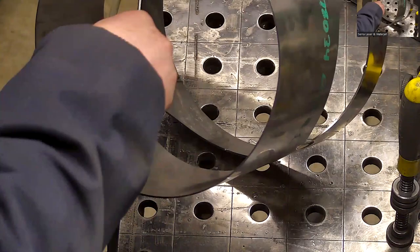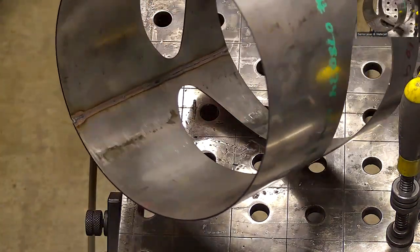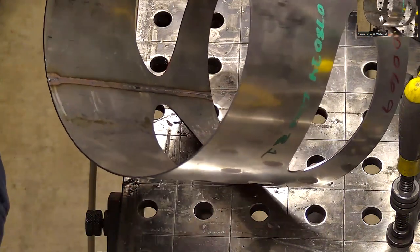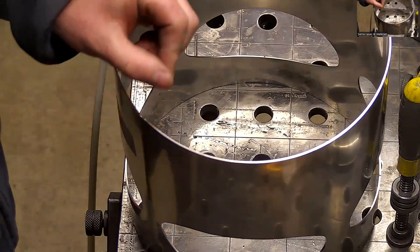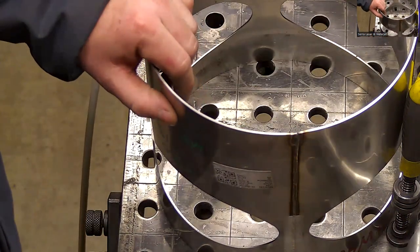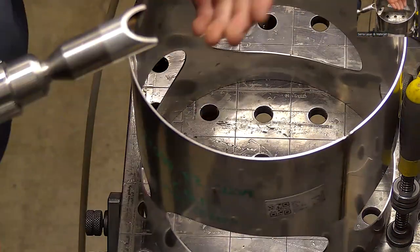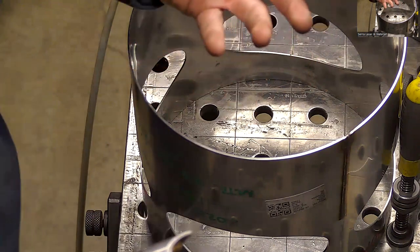Again, it's just not something that you can use with TIG welding, so it's not common knowledge that it's actually better. But with the laser, you're able to use it. So some people actually backpurge with nitrogen with TIG welding, just to save some cost. Just to say, you've got to be careful that it doesn't go up into the arc area, because then it'll screw up your tungsten.